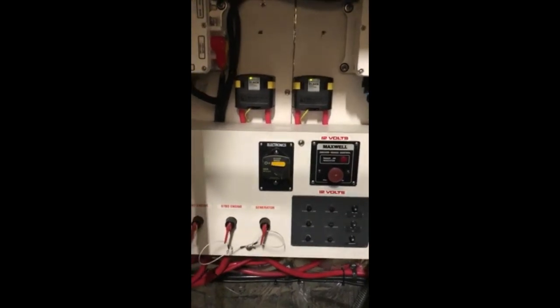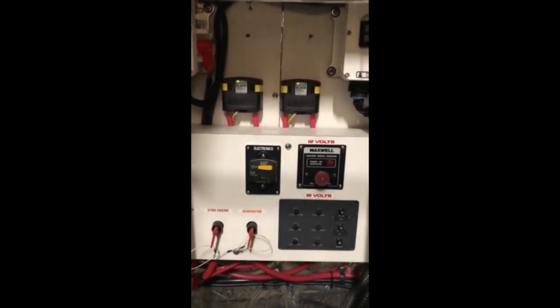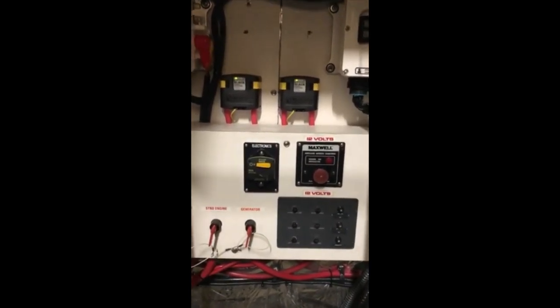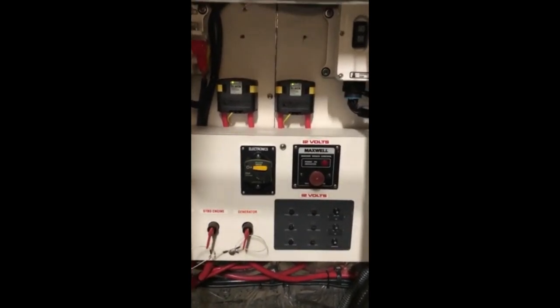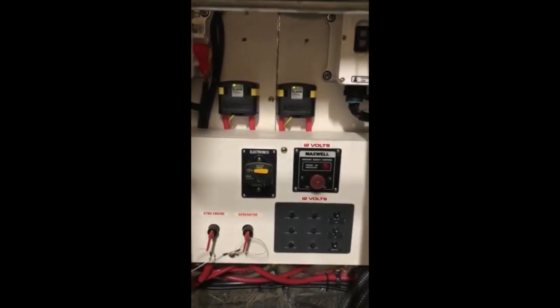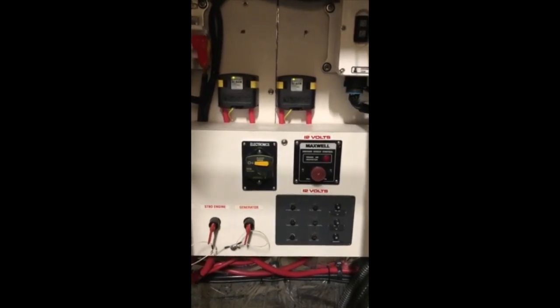If you can't do any of those things, your best case scenario is to disconnect the batteries while they're in the boat. There are certain things that will drain the batteries no matter what. The biggest culprit is typically the stereo memory on your radio. Believe it or not, that is always a hotline, and that little memory feature will drain and kill the batteries in your boat.